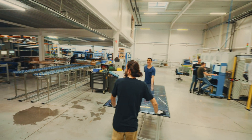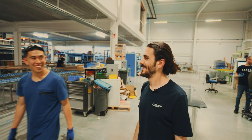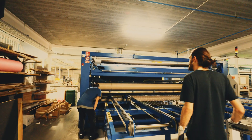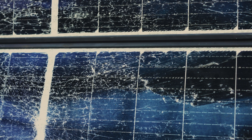This is mostly a laminator. That machine is the laminator — it's used to produce current solar panels through lamination, which is the process in which the materials are piled and stuck all together. This resin acts as a glue and blocks all the materials inside forever. It's good on one side because it gives mechanical stability to the module, but very bad on the other side because you cannot separate all the materials and you cannot open the module as in our case. That's why we avoid lamination — because lamination is the biggest problem regarding recyclability and circularity in solar panels.